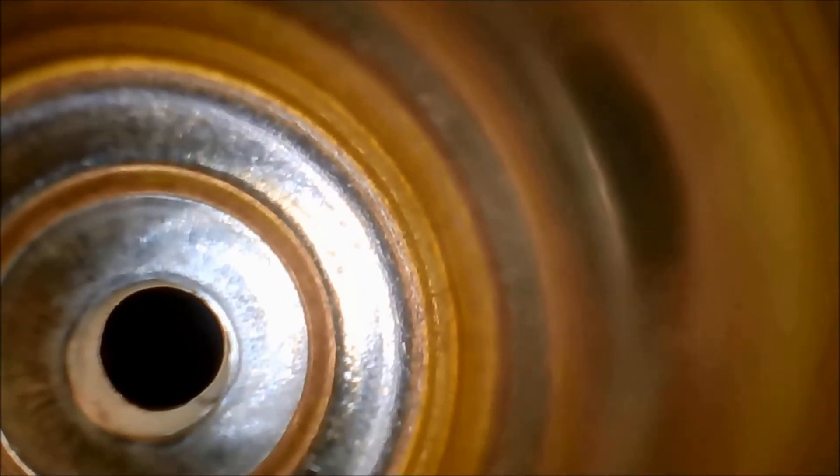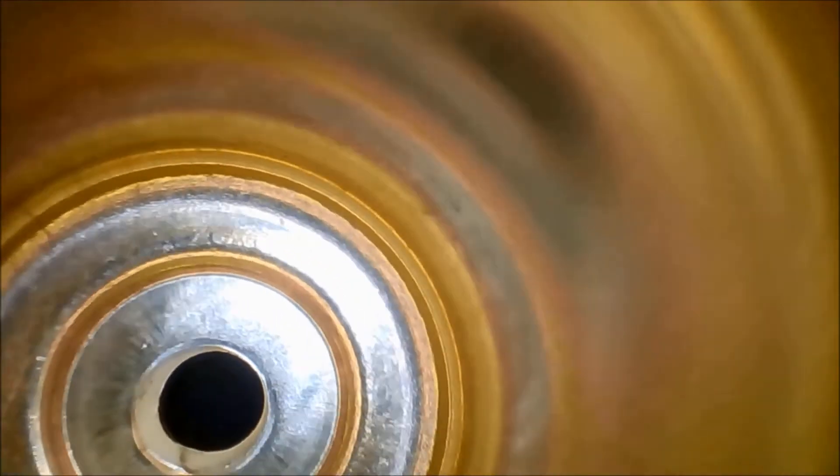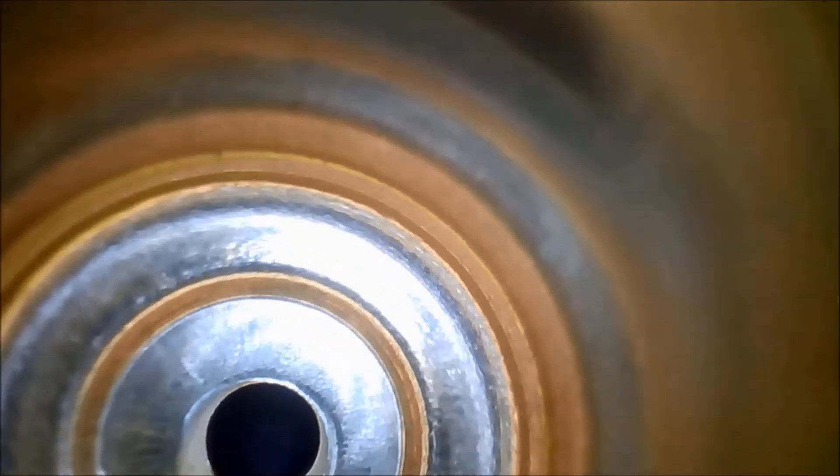The second case shows a little bit more. If you watch carefully around the largest diameter of the bottom, you're going to see some cracks — and that's concerning where they are. There's a dark spot in the upper left view; rotate it around and you can see the dark spot, and then to the sides of that are cracks down inside. This is brand new brass — never been fired at all. So there just has to be an issue with this brass.